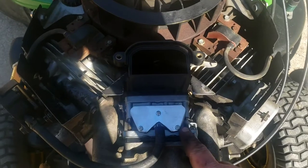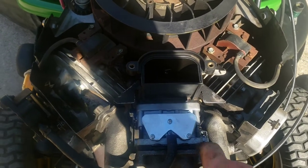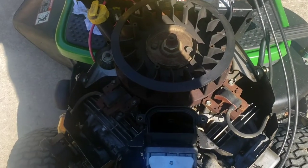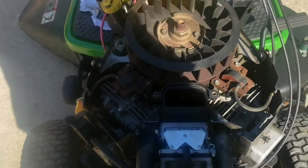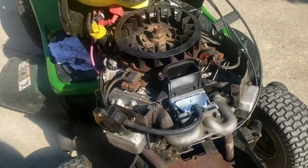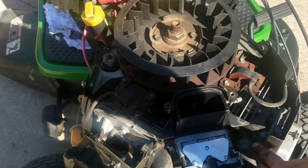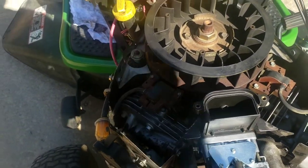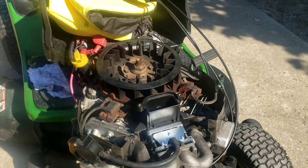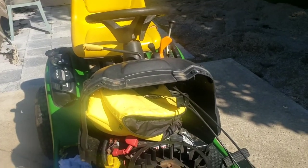These have a little metal piece that goes in between here as well. I'm pretty sure you're supposed to put a gasket on each side of that little metal piece. But other than that, we are good. It seems to be running okay. So I'm going to start it up again, let it heat up, and come back in. I'll re-tighten all four bolts to the heads, and we should be good. I'll put the top cover on — I'm just about ready to button this machine up.